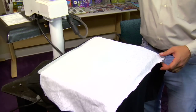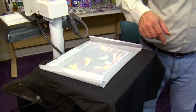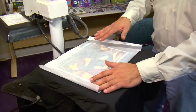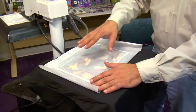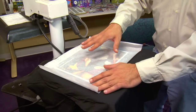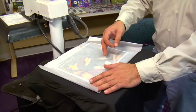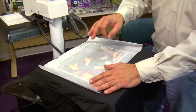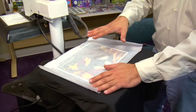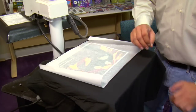Swing out the top platen and gently remove the cover sheet — either fabric or stacked plain paper. For the silicone sheet, let it completely cool before removing it. If you remove it while warm, ink may attach to the silicone sheet and you'd need a new one. Letting it cool reduces that risk so you can reuse the silicone sheet. I recommend ordering about 25 silicone sheets per 100 sheets of Jet Opaque II — you should get three or four uses per silicone sheet before replacing it.